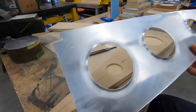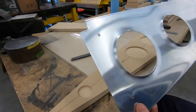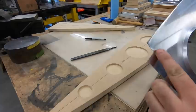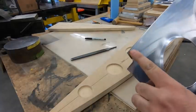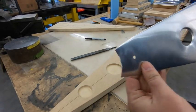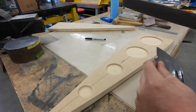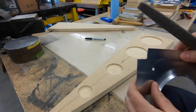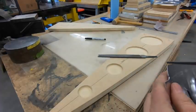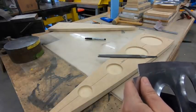Last but not least, now that these are all cleaned up, the next step will be to actually stick them in the form block and form them. But before I do that, there are a couple of areas where stress is going to want to accumulate during the forming process — which is called out on the drawings as well but hasn't been taken care of yet. So it's important that gets taken care of now. It's just as simple as dressing it out with a file. I'll make sure that my flats are flat and the radius on the inside is true and clean. Then same thing — I'll hit it with some sandpaper, some Scotch-Brite, and then we'll stick it in the form block.